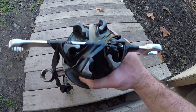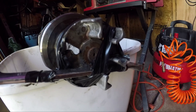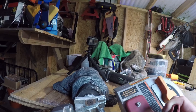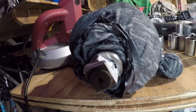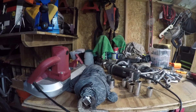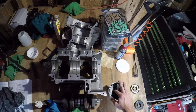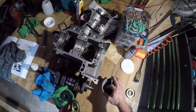In the midst of this disassembly, I needed to remove the crank coupler. I tried my best to fashion a brace of sorts to unthread it, but it was pretty well seized in place and I had to break out the saw. Luckily, this is an easily sourced part, so I chopped off and discarded the old one. For the seal assembly, I bought a container of assembly goo. I packed the seals with as much of this as I could fit — this should hopefully prolong the life of the seals for a very long time.